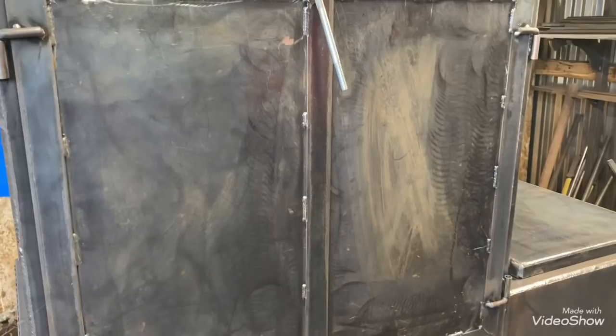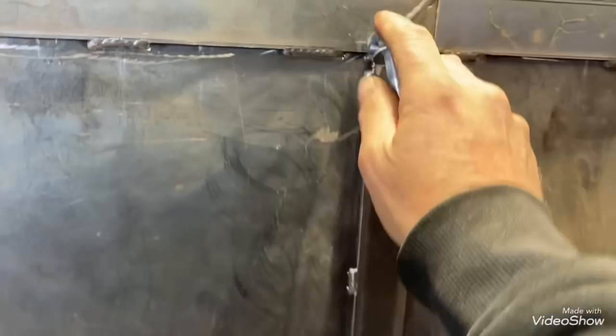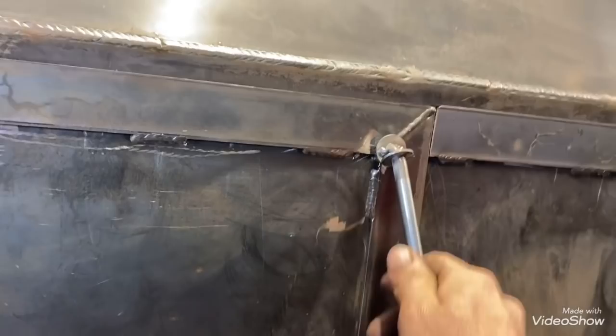It's these latches - one down there, one down there. I'm trying to do a new door setup on these cabinet smokers. I was doing a solid, one big door, and I'm wanting to do a new setup. I figured out pretty quick that both of them need to move down about right there. I'm gonna put some on that side too, but those need to move. That's a problem because now I have to cut these off on both sides and weld that hole up.